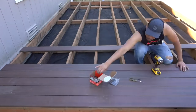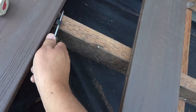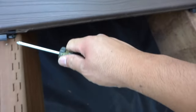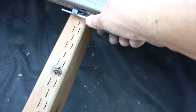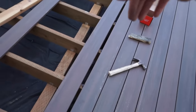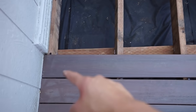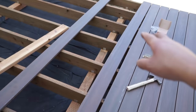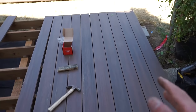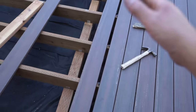I'm going to do a quick time-lapse on a few of these boards. Sometimes the clips point down a little bit, so use your flat head or Phillips screwdriver to pry the clip up so it can go through the groove on the composite deck board. That's why you start from one end and do the other end — you can push the composite board, since it's flexible, to make it look straight. If you start from one end and keep going without this technique, it gets harder to keep it straight. That's a key tip when working with composite boarding.